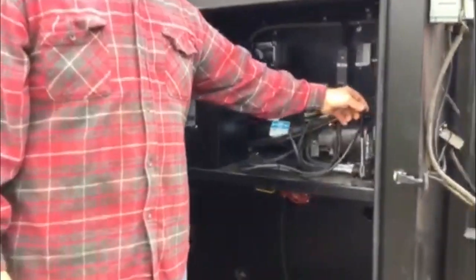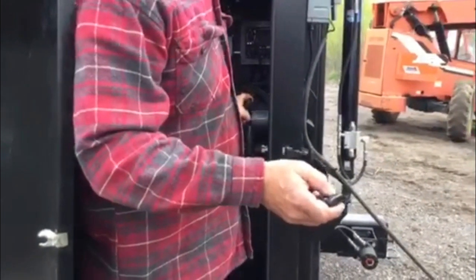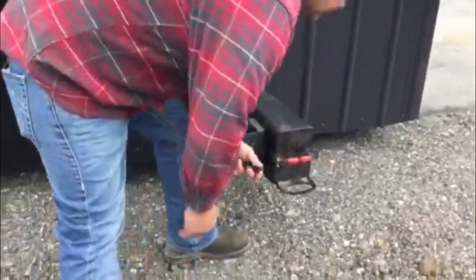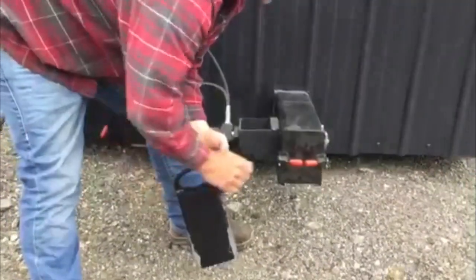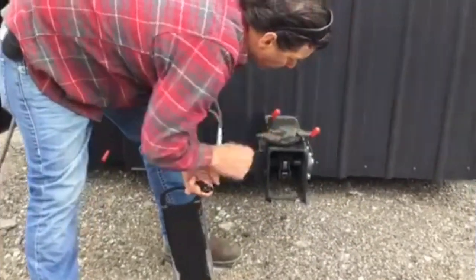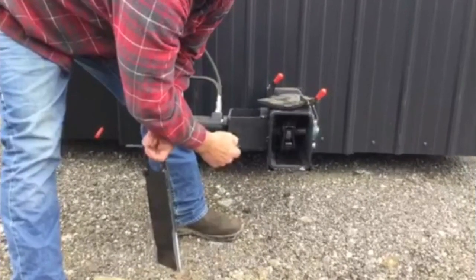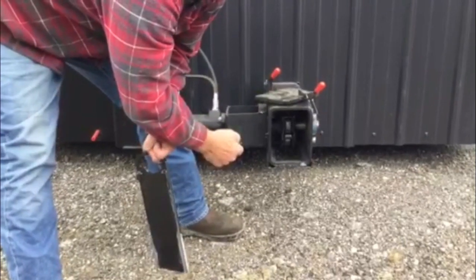And by simply shifting the spool valve, now we can operate the motor that operates the de-ash system. To de-ash, we simply remove the cover and run the motor. Here's a look at the chain. We use a pintle chain to de-ash the system, which is very quick and is great for nails and material that has a lot of hardware in it.